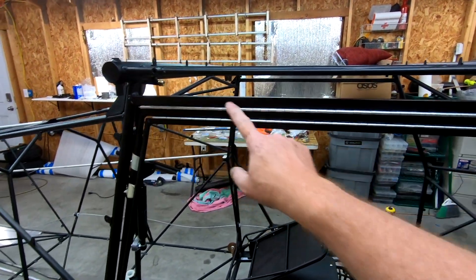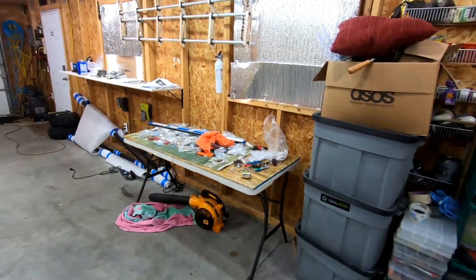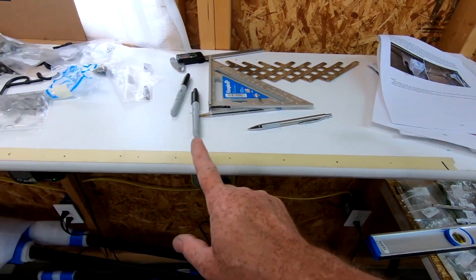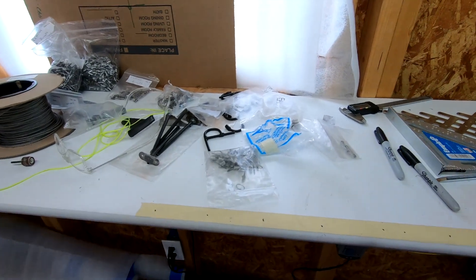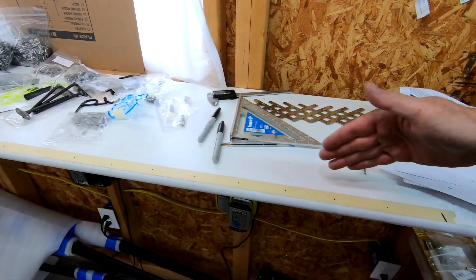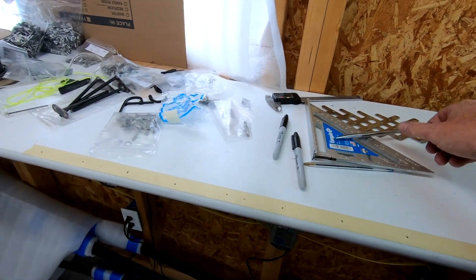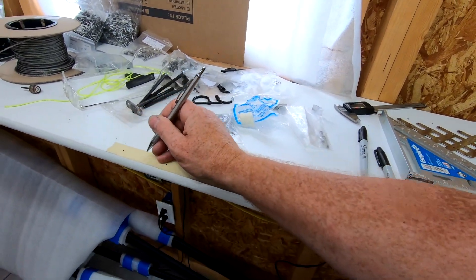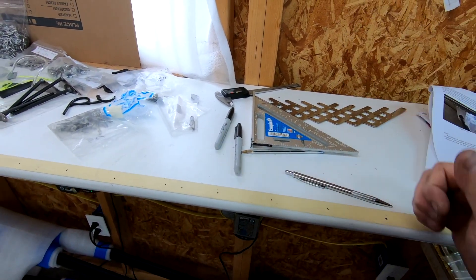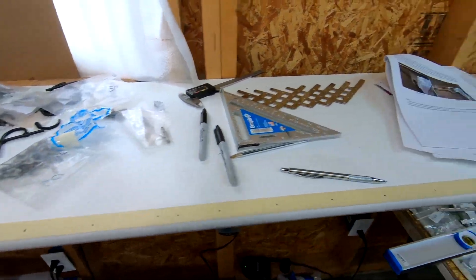Here's my advice on the hinges. I came over to my bench and put a piece of tape down, then did three-inch marks so I could lay my hinge down and mark each one with a marking pen. I laid a square on it and went right down the center of the hinge — from the outer part to the hinge itself — with a super fine pen scratcher and straight edge right down the middle. Then I used my square to make sure that when I put the snap in place to punch it, I got a nice clean centered mark for my hinges. That worked really well.